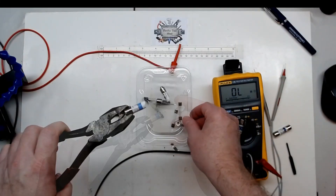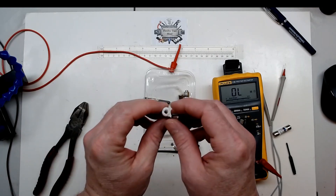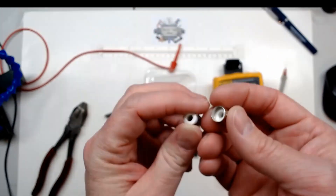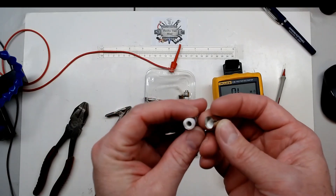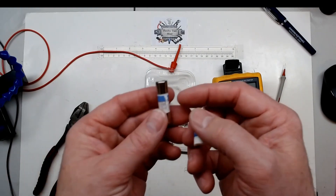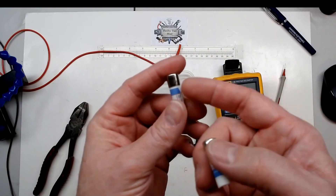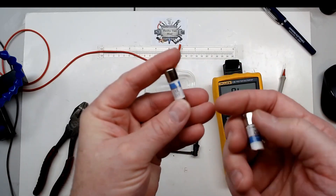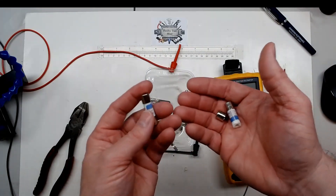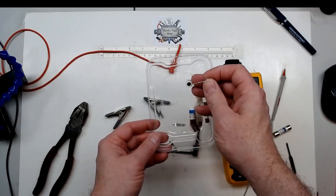The knockoff fuse got only a little bit warm at 2.5 amps — not hot. Opening the Bussmann-labeled knockoff, a good amount of sand comes out and the body is actually ceramic or porcelain. The wire element is fine enough to look almost like a hair. Interestingly, on one of these knockoffs I could actually see the wire element hanging out of the end cap where it wasn't trimmed flush — it was about half an inch long sticking out under the label. These are also not wrapped in the rejection-style format.